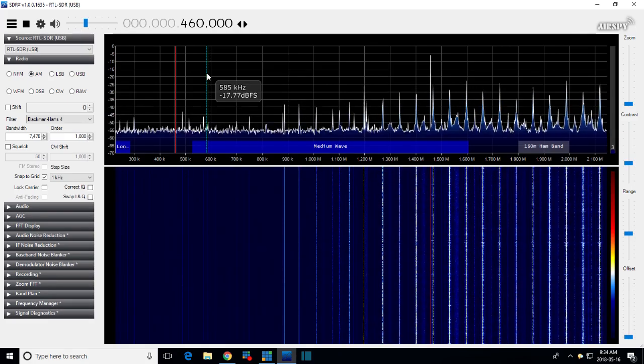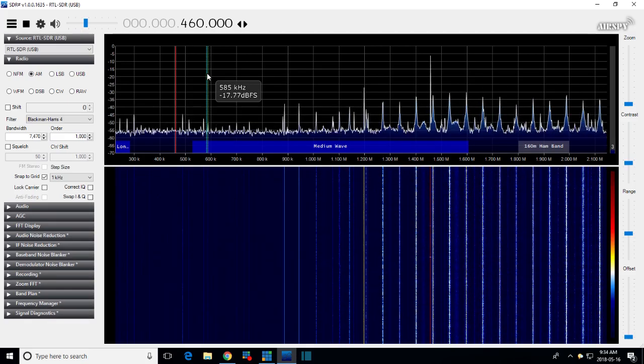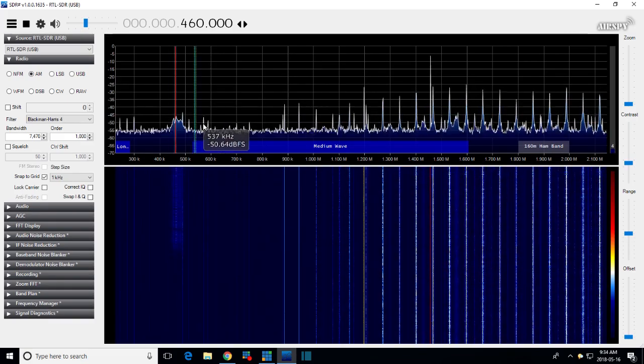Son of a gun. So I'm struggling to see the front end here. It's not happening. One more attempt with the sweep signal generator on the antenna. There you can hear it. It really doesn't seem to produce much of anything. We can hear it, so it's got to be in the IF, if we can hear it. Okay, cranked up the output full. Now you get a real good look at the IF down here.